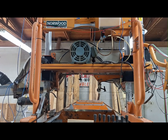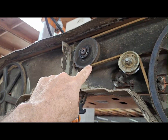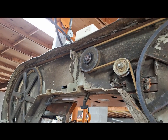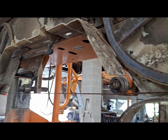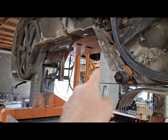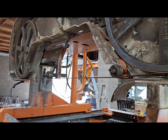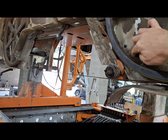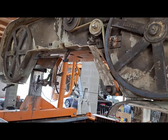I still have to get a pulley puller. I have to get this off that electric motor so I can get my new engine on here, and I don't have one here — somebody's going to bring me one tomorrow hopefully, and I'll be able to pop that off. Then I'll be able to take the motor off and get the predator engine on here. My clutch is in the mail. I did put a blade on today just to see about tracking and adjusting where the blade rides forward and backwards. I did get two working roller blade guides on here with ball bearing rollers and they both work, so I got them going today — I forgot to mention that earlier. I am getting it — I can manually spin it and everything works by hand.